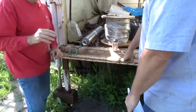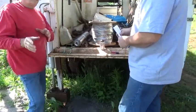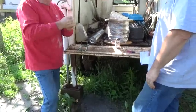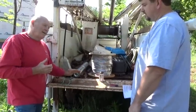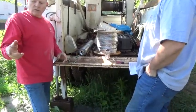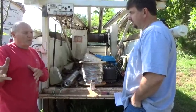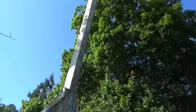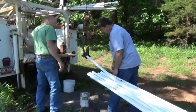On a deep setting, the industry standard — and I see a lot of guys never do this — is I've pulled pumps set at 500 feet and that's the only check valve they have. The standard is a check valve in-line every 200 feet. What happens is when the pump goes off, all the water hammer comes back down and does a number on the impellers. And if that check goes bad, it's going to keep leaking back and kicking the pump on all the time. Having a check valve in-line helps that. On this one, we'll run the check at about the seventh length — around 280 feet.